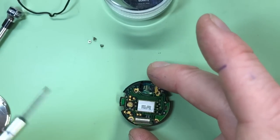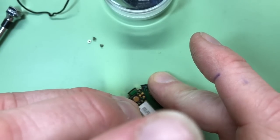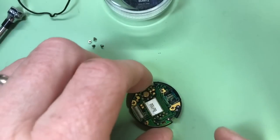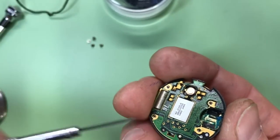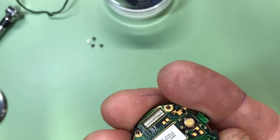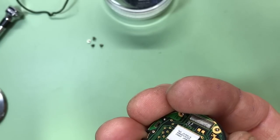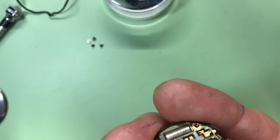I have no idea what to expect. After working on quite a few of these they're usually pretty straightforward. With the four screws removed I need my thinner yellow-ended screwdriver - I think it's 0.8 of a millimetre on the ends, for anybody that wants to know. Then we need to have a look at how this is all held in and how we remove it - looks like a bit of a prying action on this one.